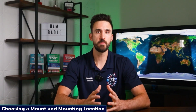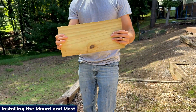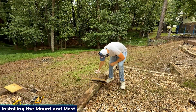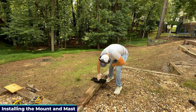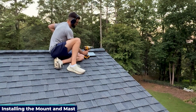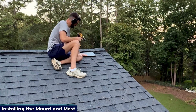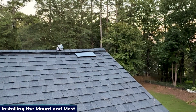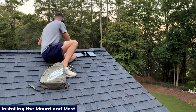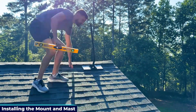Since I'm installing directly into the roof, I'm using a one-by-six inch piece of pressure-treated wood underneath my mount, painted with sealant and black paint for extra stability. I've picked a spot on the highest part of my roof, drilled pilot holes, then placed two-inch outdoor screws to secure the mounting plate. I'm using a sealant tape to cover the holes, and you can also purchase sealing tape purpose-built to seal the holes underneath the mount. Then I'll connect the mast with the included bolts, using a level to ensure it's as straight as possible.